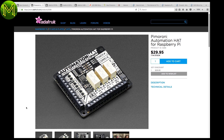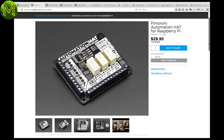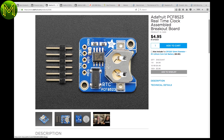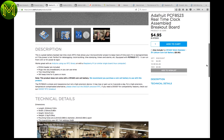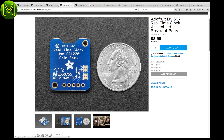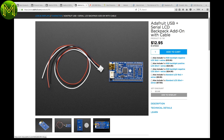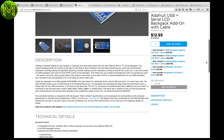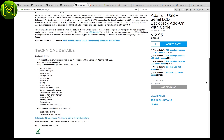There's the Pimoroni Home Automation Hat, which contains ADCs, inputs, outputs, and relays, all supporting up to 24V. If you're looking for real-time clocks, Adafruit have two new ones in stock: the DS-1307 and PCF-8523. The only difference between them, apart from price, is that the DS-1307 requires 5V. This nice little board allows you to control any 16x2 or 20x4 character LCD with PWM backlight control. You can send commands by either UART, or it also has an onboard USB port. It contains onboard EEPROM so you can save customisations.